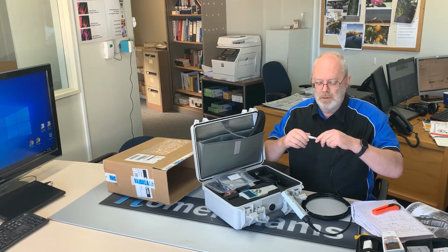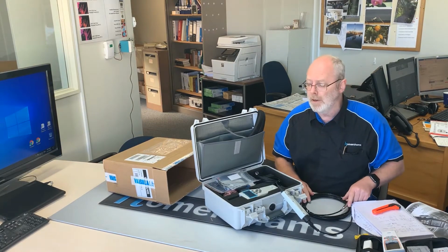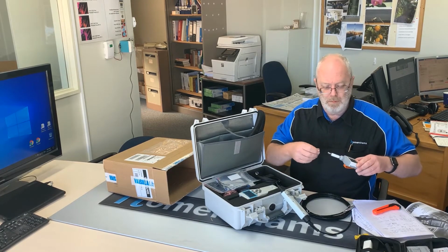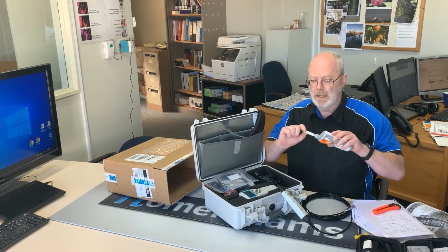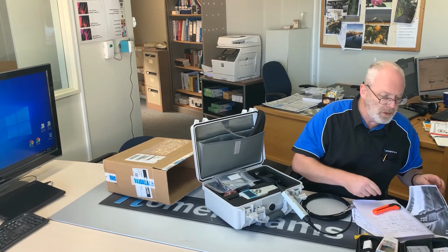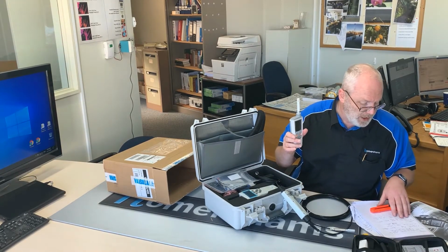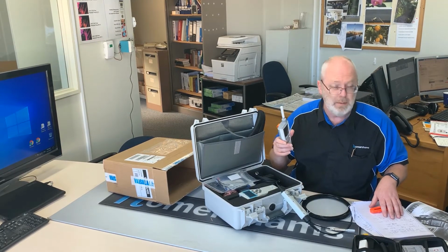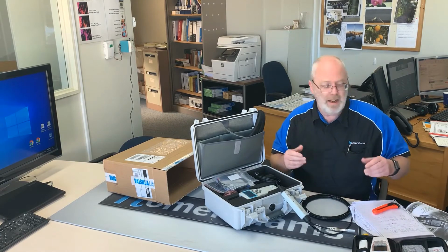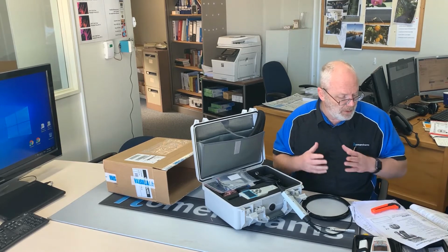It's so good, for example, that it's used not only on this planet. On the Mars Perseverance rover, there are Vaisala humidity instruments. HumiCap is, of course, a brand name of Vaisala, but it's quite common to see other much more simple capacitive types on lower cost instruments. The HM40, by way of example, is 1.5% from 0 to 90% at 40 degrees C and 2.5 at 90 to 100. Now, one of our other brands that we sell, which is actually a very good instrument, has a much more generic specification, and this is typically what you'll see.